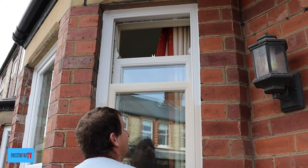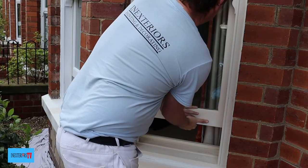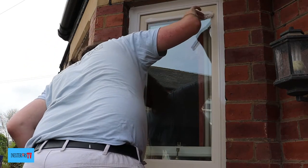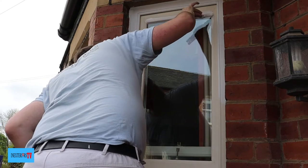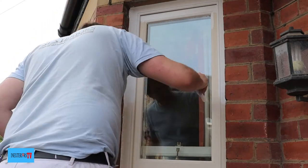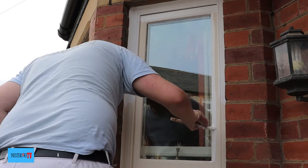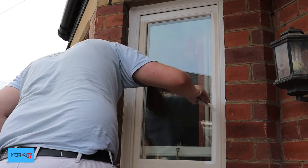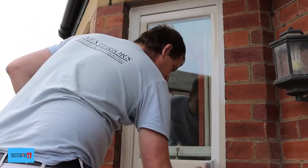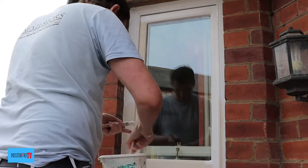The top part is all done. Now we slide one sash up to the top and the other down to the bottom, giving us the full face. You might get some scuffs on the inside where you pull the sash back up, but it can't be helped unless you let it dry. With an oil-based paint that would take a long time, so you'd have no choice but to get on with it. I am using a hybrid water-based undercoat and top coat, so I did leave it to dry before pushing the sash up.